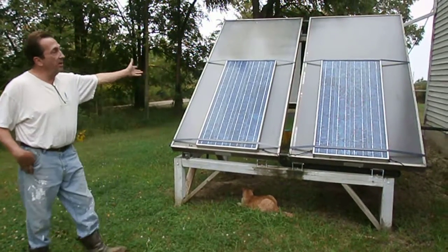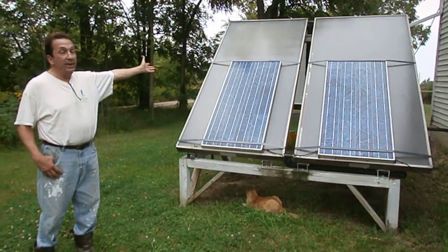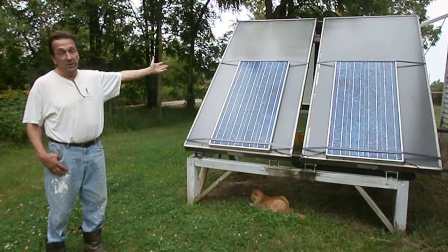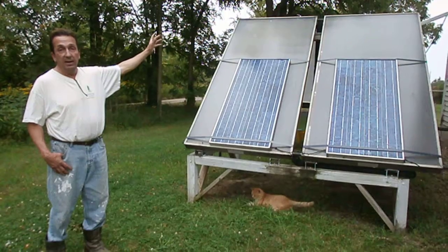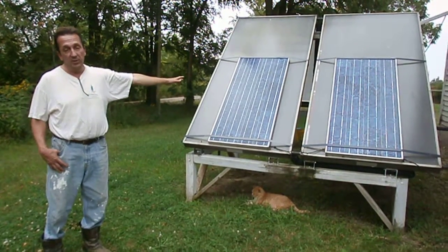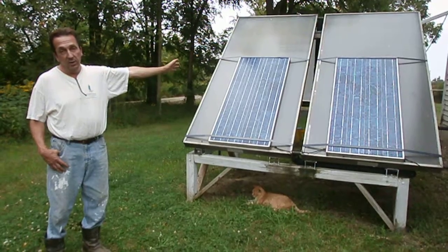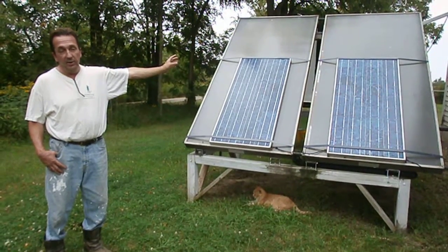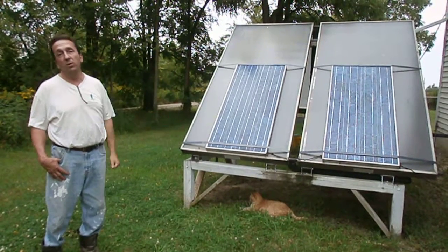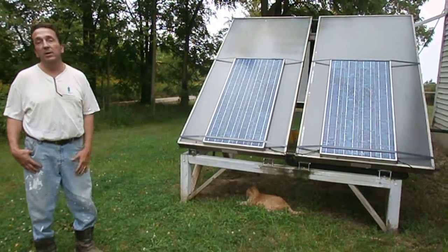The panels that are on the back are 4 by 10 panels — a radiator in a box, if you will. Water is circulating through those panels as we speak. The sun hits the panels at 90 degrees or above and starts the circulating pumps driven by the photovoltaic panel. That water is then circulating and brought into a storage tank in the basement that reheats the domestic hot water prior to going into the regular domestic hot water tank.